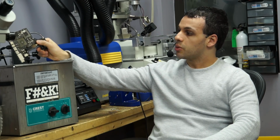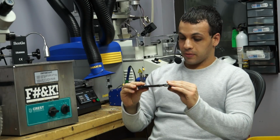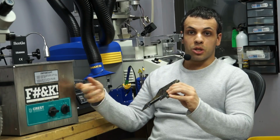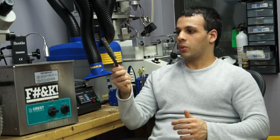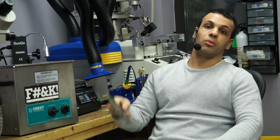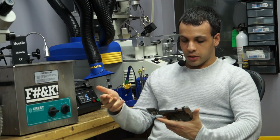back onto the machine. So it uses a process called cavitation to do this. Now, one of the things that you should look for, firstly, when you buy one of these machines is something that has a sweeping frequency. So the frequency will go up and down, and the whole idea behind this is it winds up just getting to every single little point on the board and also not bombarding the board with the same frequency over and over again. So the point to get across here, don't buy a jewelry cleaner.